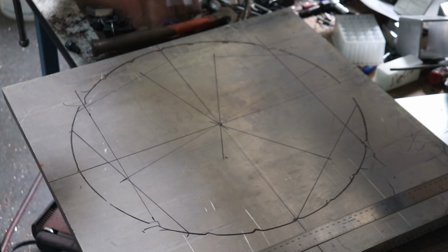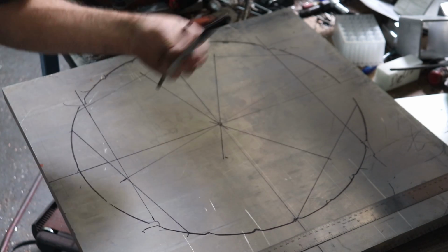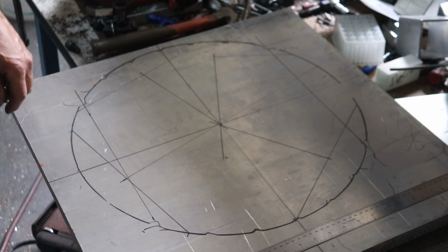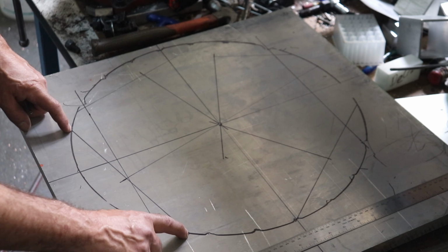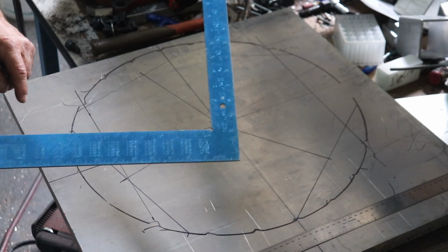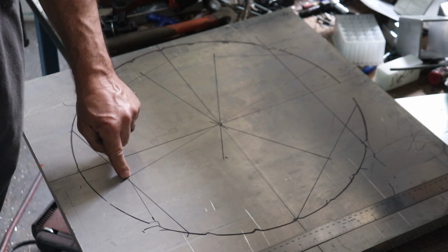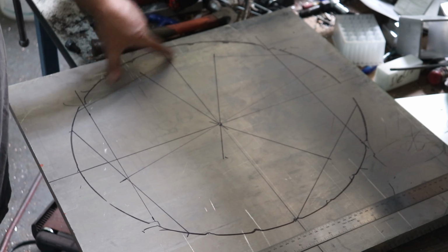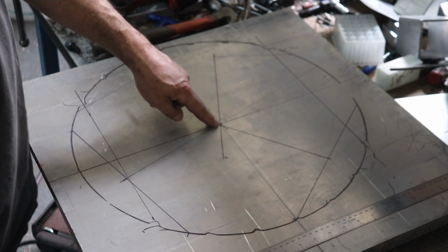And then I used the Sharpie, and I basically traced the circle of the mill table onto the bottom. I kind of reached up and under and traced it. And you can see indents for the table slots. And then I did some old geometry from grade school, where I measured 12 inches on that would intersect with the perimeter. And then if you find the 6-inch center of this line using a carpenter's square, and then draw a perpendicular at the exact center of this line using the square across your circle, then somewhere that line is going to go through the center of your circle. Then if you do that same process in a few locations, then all of your lines will basically intersect and show you the 0 point of this circle.